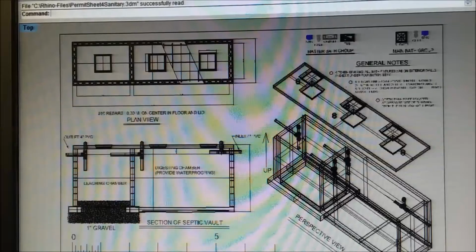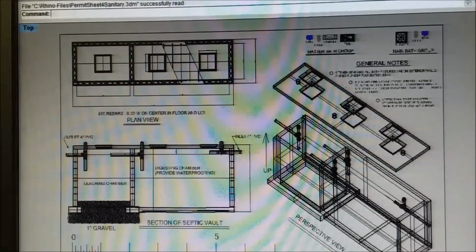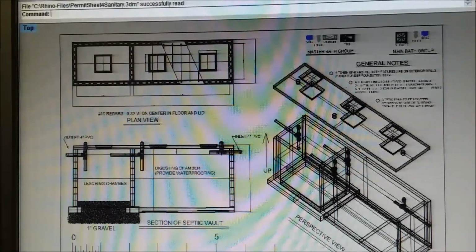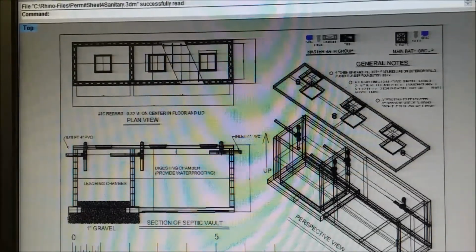Now, say you had a two tank system, and you wanted to do some other water cleanup, another stage in the existing tank. You can put like a 6 or 8 inch PVC pipe, stand it up in that tank, down into your gravel bed or whatever you got underneath of it. Hopefully there's a gravel bed. I don't know where it'd go if you didn't have that. But you can put a standpipe in there to let the water build up to the height of the standpipe.